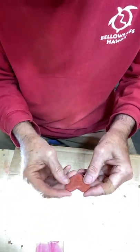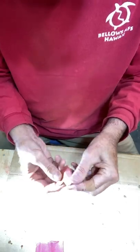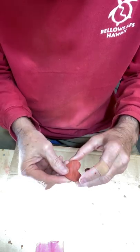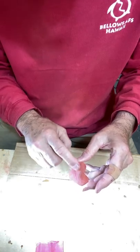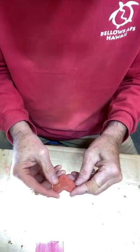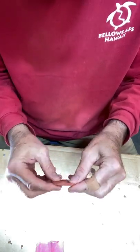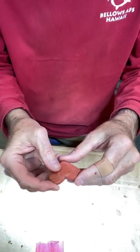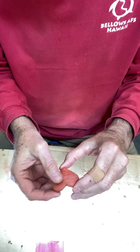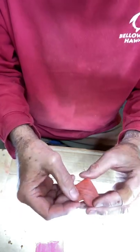I ended up sanding all the way through 400 grit. I like to do that because it gives such a nice, silky-smooth feel to the heart, and I was able to remove probably 95 to 96 percent of the little hairline scratch marks. It's really important, especially with this wood, to sand with the direction of the grain. Now I want to show you the really cool part about this wood — I'm going to put some oil on it and watch this wood just come alive.